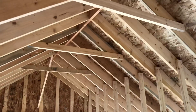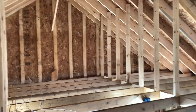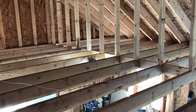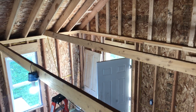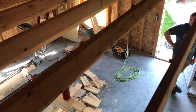There's only six feet between the bottom of the collar ties and the top of the rafter ties. I don't think in this situation it's wise to throw an attic up here — I'm not comfortable with that unless we went out to two-by-eight ceiling joists and had some thicker pieces like two-by-sixes plated on and stuff. So there won't be any storage up here. We're just going to blow in insulation and heat the lower half. That is how we are framing in and changing from a conventional non-heated garage — conventional framing, four-foot-on-center rafter ties, four-foot-on-center collar ties — to be able to hold drywall underneath. That's a pretty common renovation.